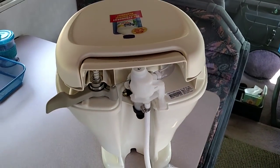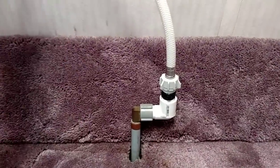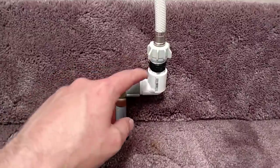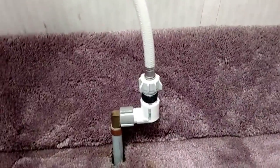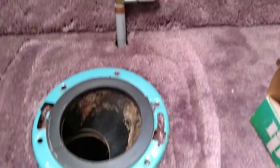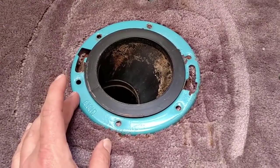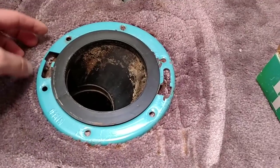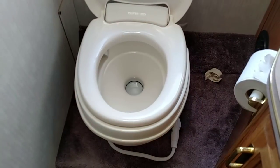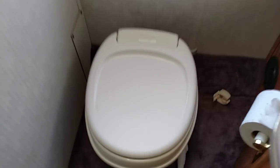We got the new plumbing installed — the new feeder line. We bought the elbow and the black adapter goes to the feeder line. All they had at the store was a too-long or too-short one, so we wrapped the ends with plumber's tape to help give it a good seal. We've got the bracket measured to where it's going to fit and hold down with the two new bolts — we turned it from where it was with the old toilet — and now we've got to drill it in with some new screws.